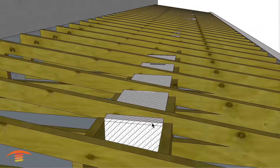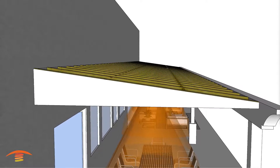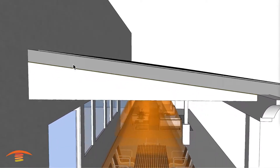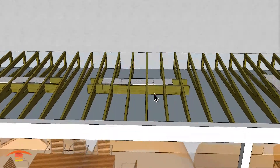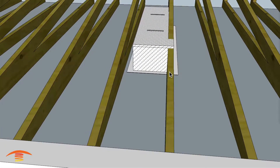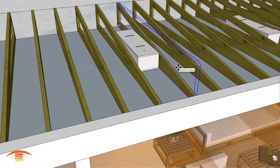This is not structurally sound as drawn, but if you look at it from this angle and we put the rooftop back on, you can see there's some added space. This is your roof and this is your false ceiling. On this side you'd have to box it in this way, and on this side you'd have to design it so that the rafter system would work out appropriately for the spacing of the heater itself.